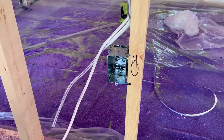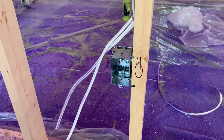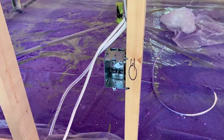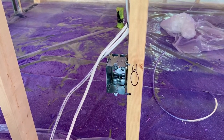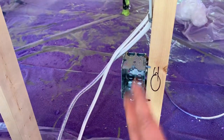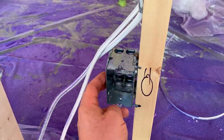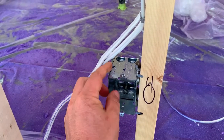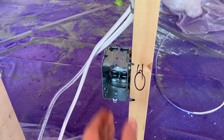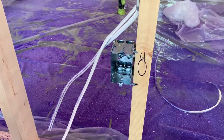Here we have a receptacle in a rough-in installation. There are several things to talk about before my journeyman ties this in. First, we use a metal box. A lot of contractors use plastic boxes or all different kinds, but the reason we use a metal box that is not welded and has gangable sides is simple: after the drywall is on and the customer wants a double plug, it's much easier to remove the side and extend the box. With a welded box, you'd have to pull the whole thing out, causing drywall damage.